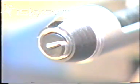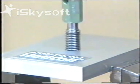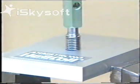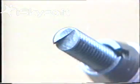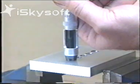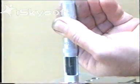Inserting the helicoil into a tapped hole is a relatively easy operation. Successful installation is dependent on having a properly prepared hole, using the correct tool with a good end form, never pushing whilst installing. Let the insert do the work, and above all, be gentle.